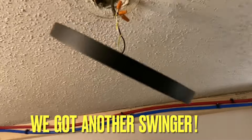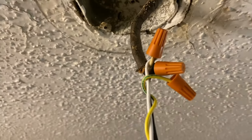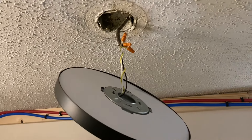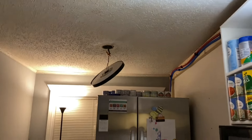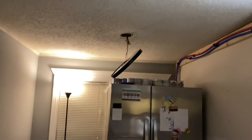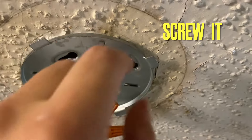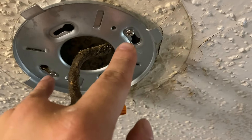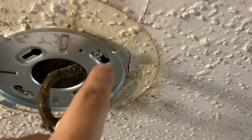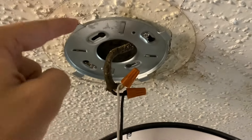This is what I have now — the light is hanging. It is hanging with white to white, black to black, and the ground wire I just capped because there's no ground wire in this old system. All I got to do is turn the light switch on and we'll see if it works. To mount it, I got this screw and this screw started by hand — righty-tighty — inside those holes where we took the old bracket out. Then I took this bracket off of the connection, just kind of twist it off, and you can see these little hooks right here.